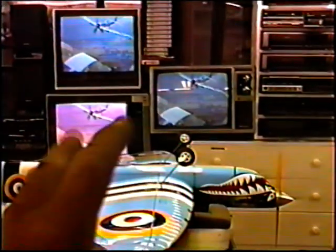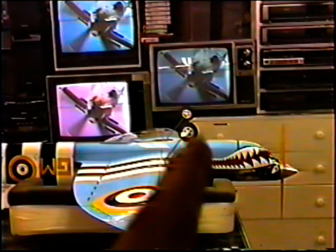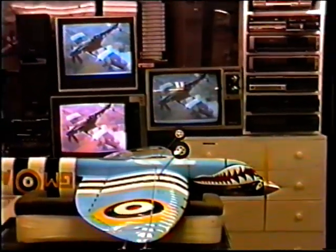And things like the pipe and putting different spinners on, it's all going to need to be fine-tuned later. But right now we need to know that we're close. We need that wheel somewhere in a position where it'll just let the tail fall down the minute I let the nose go. And once we have that position, that's a good starting point. Now we can make up the gear legs.